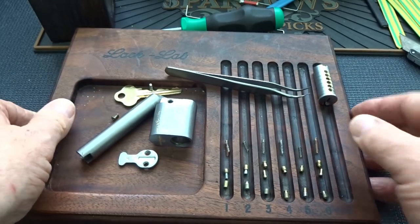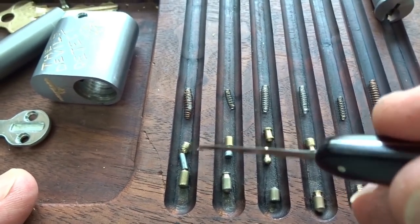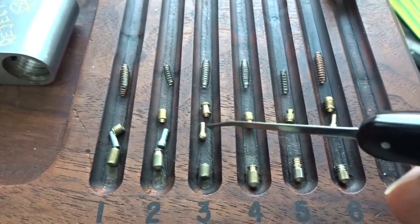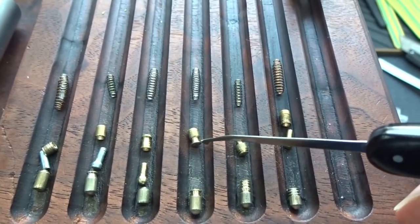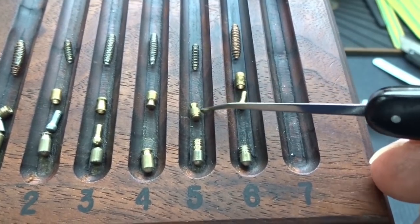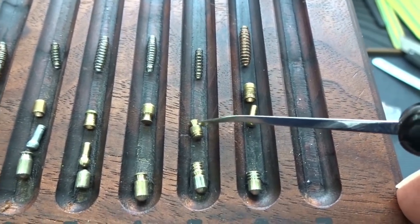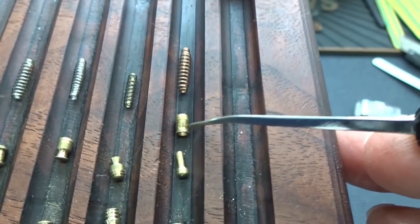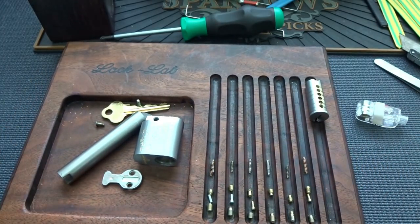James, I appreciate all the effort you put into this. Let's take a close look at these pins. A lot of pin-and-pin action — one has a removable sleeve with fine serrations, another is a removable pin-and-pin with a spool on the sleeve. Two are homemade spools with very sharp edges to grab the undercut. We had a threaded chamber with serrations, and on the last one a pin-and-pin in a threaded chamber with serrated key pin and fine serrations on the moving sleeve. Awful tricky lock out of Australia — appreciate your time, stay safe, stay legal guys.